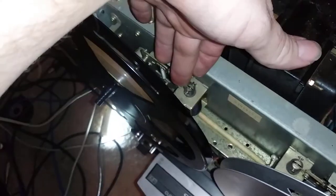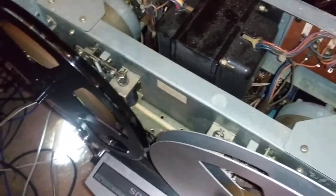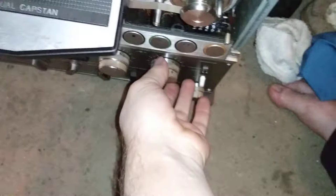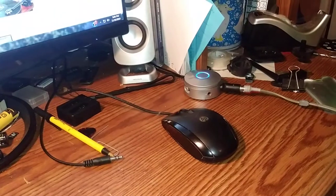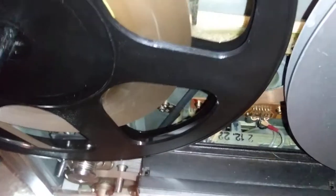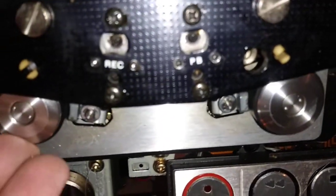When I hit play, rewind, or fast forward, this drops. I'm messing with that to try to get it to play — I can get it to play for about a minute before it loses tension again. Sound only comes out of the left speaker. This is for line output, line in — adjusting the volume does nothing; everything's adjusted by the speakers. The right-side reel just needs to be threaded correctly. Those dual capstans are controlled by a solenoid — they were gummed up so they wouldn't engage.